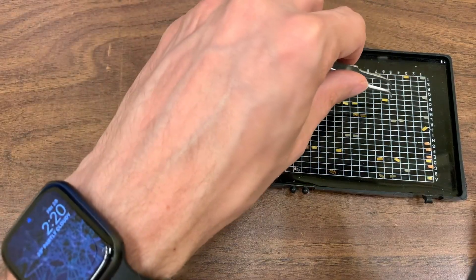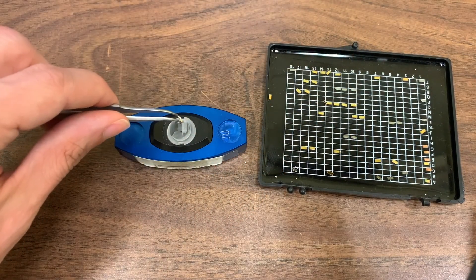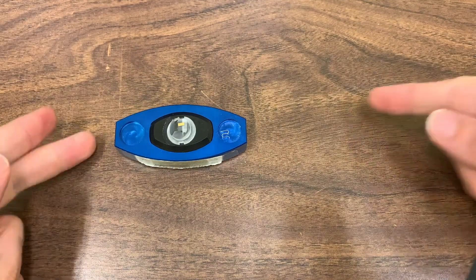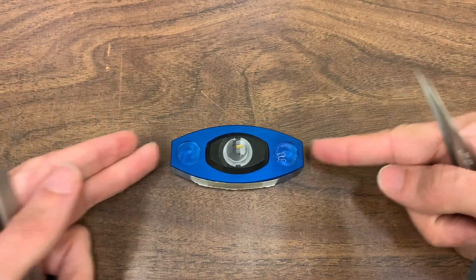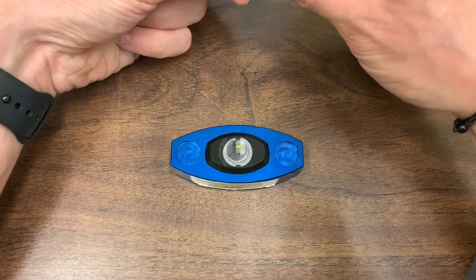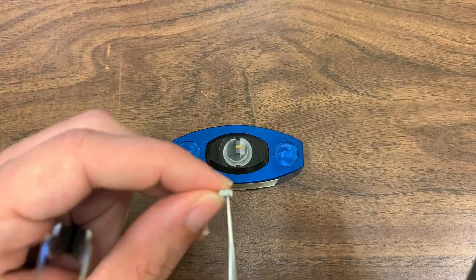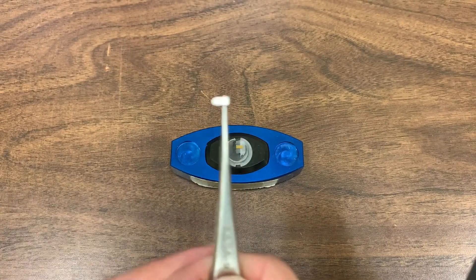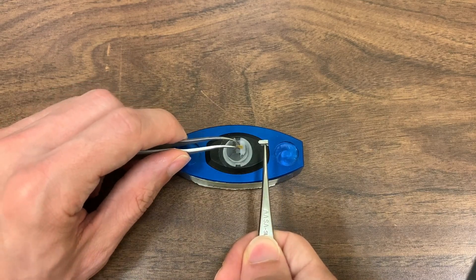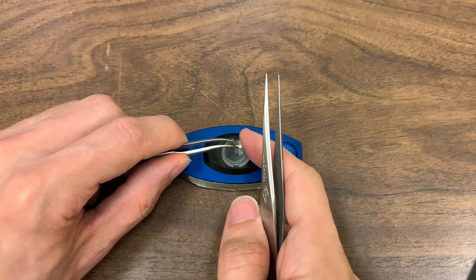Now the tough part. We have to pick up our AFM probe of choice with some tweezers and carefully clamp it down on the glass AFM holder. The AFM probes are quite tiny, which definitely challenges your fine motor skills. Not to mention, you will be dropping and breaking a few AFM tips before you become consistent with this part. This can be especially nerve-wracking as AFM probes can range from $20 to $30 a piece for more basic probes to on the order of $100 per piece for very specialized tips. Pro tip: it's best you practice on your already broken tips over and over again until you've got it.